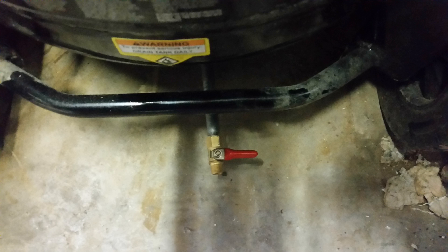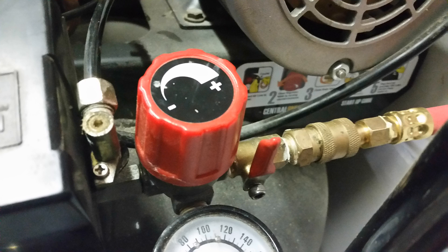I have not tried to move the compressor yet. I do suspect this rig is going to interfere with rolling the compressor. I may replace one of the 5-inch nipples with a 4-inch nipple to gain that additional inch of clearance. Our last step is to uninstall the original coupler from the output side of the compressor. We unscrewed the coupler, applied pipe thread sealant to the male ends of the compressor output and the 1/4 inch ball valve, threaded it together, and threaded the coupler back on. During testing, the ball valve from my toolbox turned out to be defective. The second new ball valve purchased from Harbor Freight was swapped in, and it's working fine.